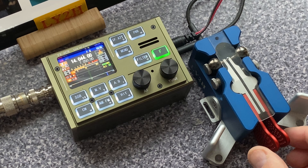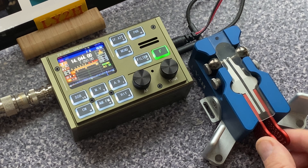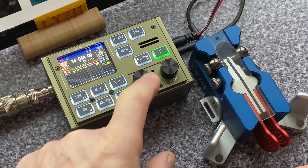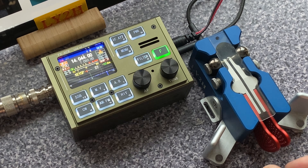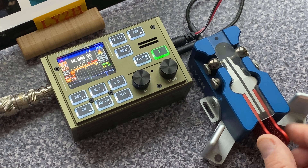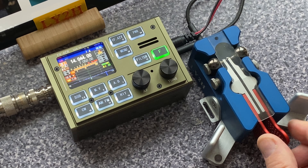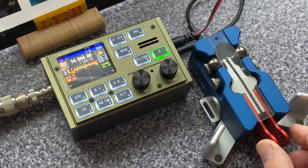To eliminate the first reason, I quickly jumped back to my shack and ran heavy-duty CW at 20 watts into a dummy load for a full five minutes. The result: no problems, no overheating on touch, and no power drop at all. Warning: the manual recommends 10 watts on CW, so if you run 20 watts you do it on your own responsibility. The most probable reason left is RF in the shack, and it needs more investigation and field study.